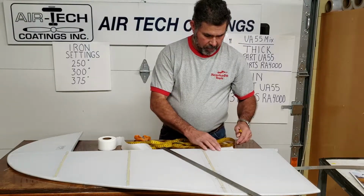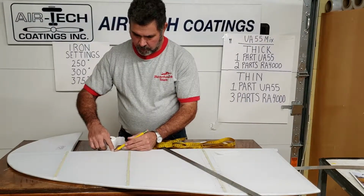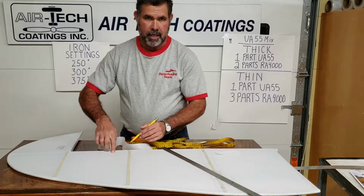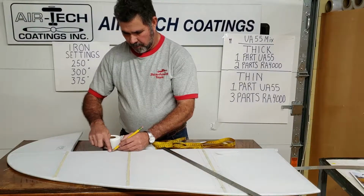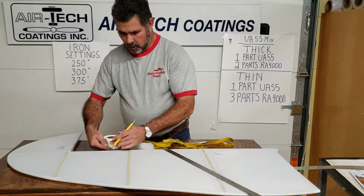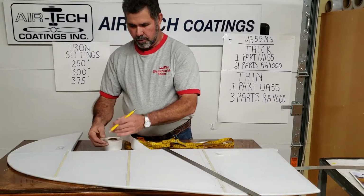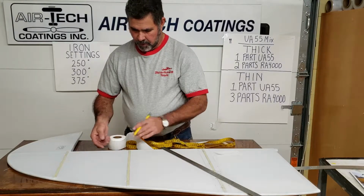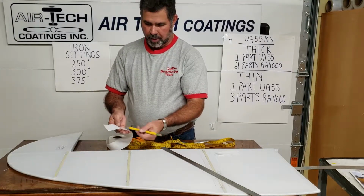The reinforcement tape up here, as long as your reinforcement is out on the open weave, whether it's a ½ inch or an inch or whatever, as long as it's out on it, that's all it needs. Now, one way you can do it is, take your flat tape, go all the way around and measure and see what comes closest, like a 3 inch or a 4 inch wide or whatever it's going to take to go from one side to the other, and then cut that piece. Say it was a 4 inch wide piece or a 3 inch wide.